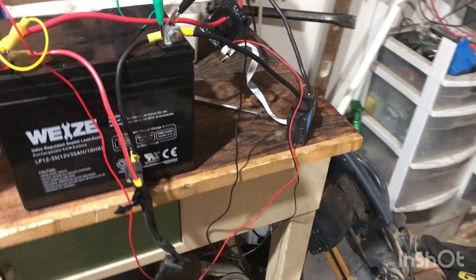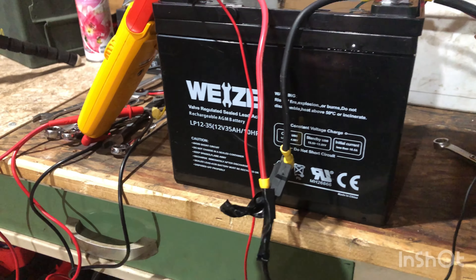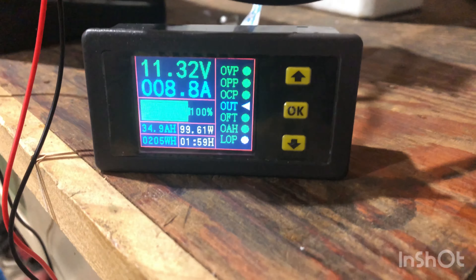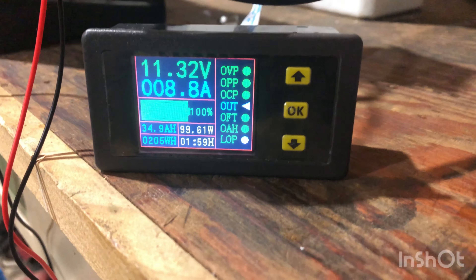Going to check the voltage on the battery itself — we're about 11.9 volts under load, and when we're not under load I'd say we're about 12.2 volts. So we're probably right around 60% capacity. I may even take this down to 40% since I've cycled this battery a few times and it is still a brand-new battery with only a few loads on it. Capacity would be slightly higher on a fresh-off-the-shelf battery. We're at 132 watt hours and up to 28.6 amp hours.